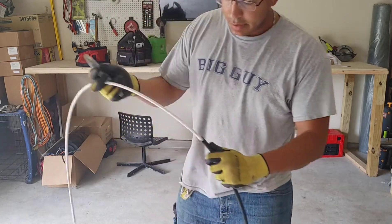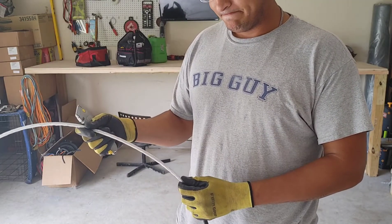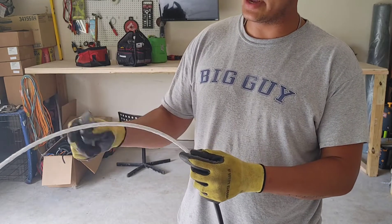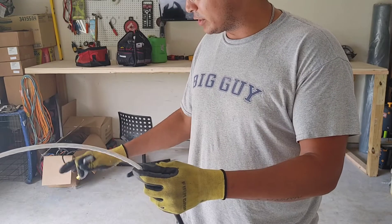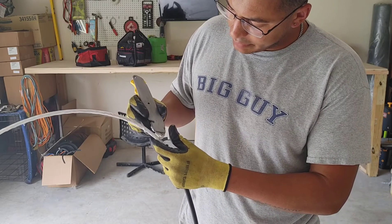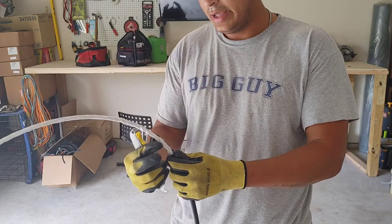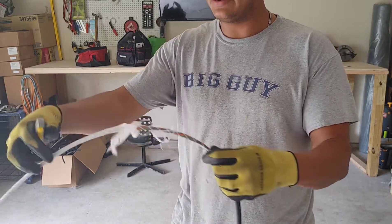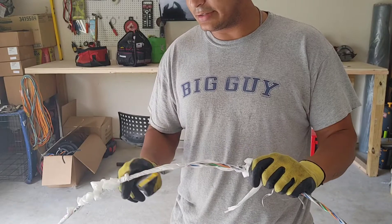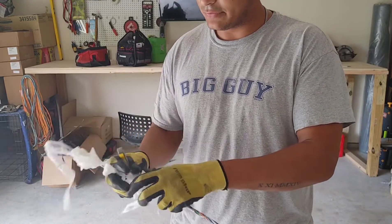Now we have — I don't remember what it's called — but it's to control moisture. Whenever this gets wet it swells up and tries to prevent moisture from getting throughout the whole cable. I've never seen it work, but they have it on there. It's going to be a set of two — I have these two white strings and I'm pulling them off now, then I'm going to pop that sleeve off and shimmy it down. I'm grabbing this side and this side and shimmying it down, because if you get it to fold over itself it's going to get stuck. You'll be cutting it off and you're in danger of cutting the fiber when you do that.